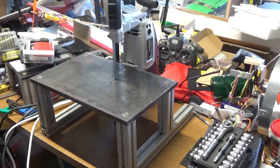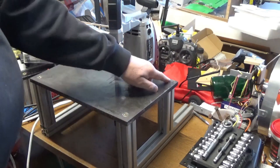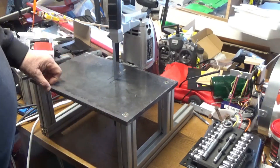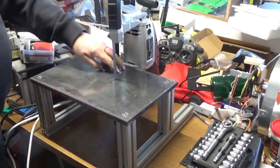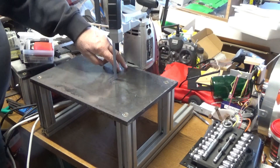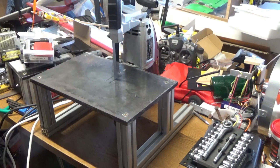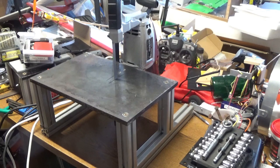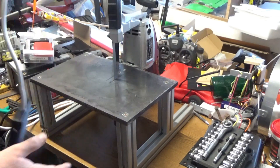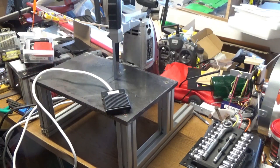I got the assembly done. I got my 8mm flathead screws into the feet, and the bottom rail extends back so that it's not tippy. I drilled holes and countersunk them to mount the saw into the table with a slot cut for the blade. And I have a foot switch to operate it — I put that foot switch together.